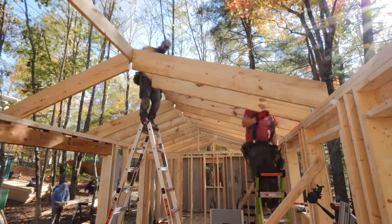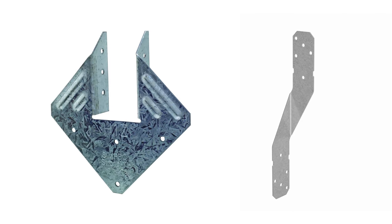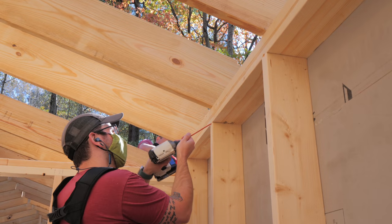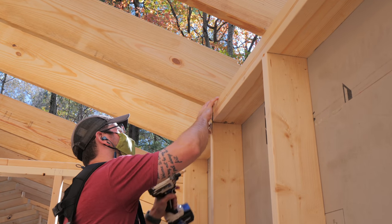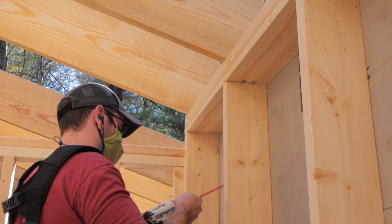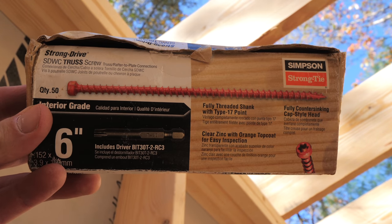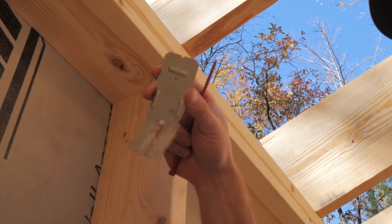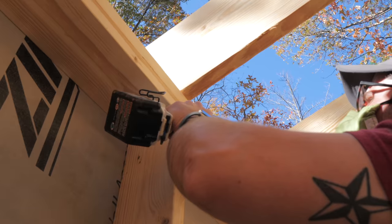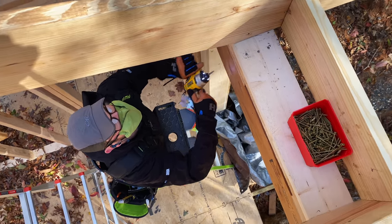With the rest of the rafters set, I went around and permanently attached the rafters to the double top plates. There are a few ways to do this — the most common probably being metal rafter ties or hurricane ties — but installing those is incredibly time-consuming due to how many fasteners are needed per tie. Instead I went with truss screws, which I saw in one of Eric's videos. These are designed specifically for connecting rafters or trusses to top plates with a single screw at each location; the package includes the screws, a driver bit, and an angle guide. Considering the pricing is roughly the same or cheaper, I'd definitely use these screws on future builds — and this isn't sponsored, I just think it's a cool product.